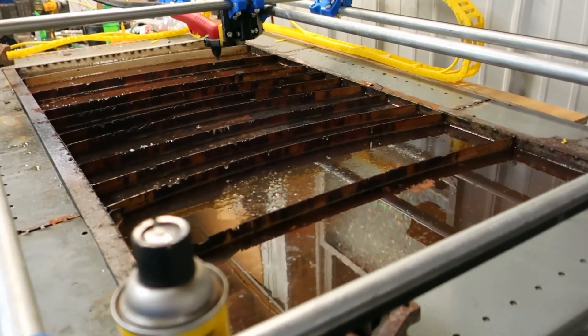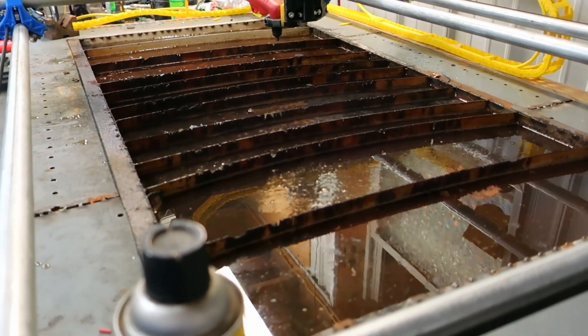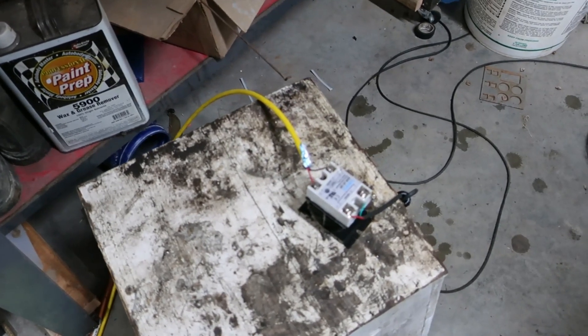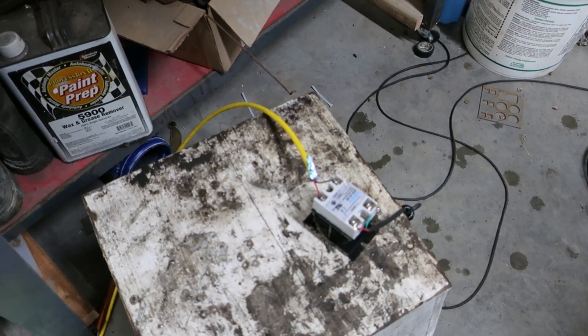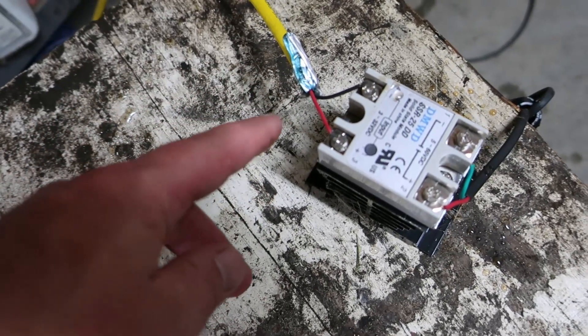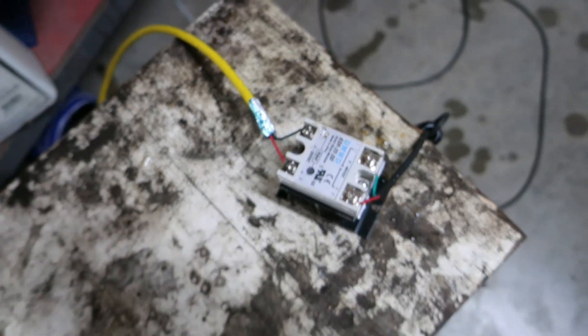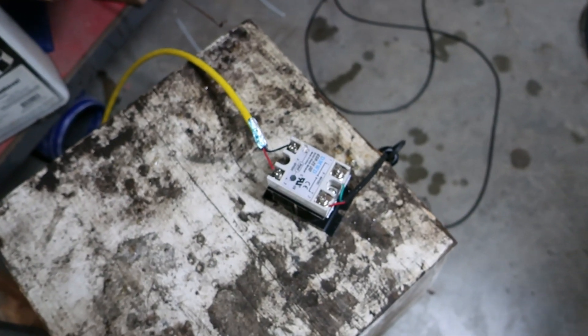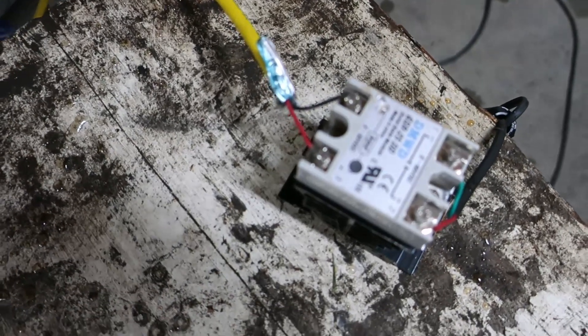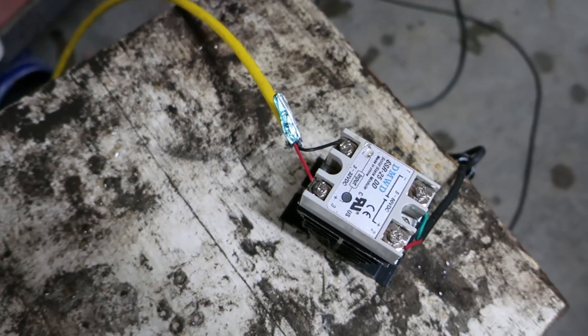So I've done a few tests and we'll see what we'll be able to do here today. I had some trouble where this CNC wouldn't move. Turns out I had a shield wire hanging off here that happened to land on the positive - just barely touch it. It was underneath the work bench, I didn't see it. Got that working.